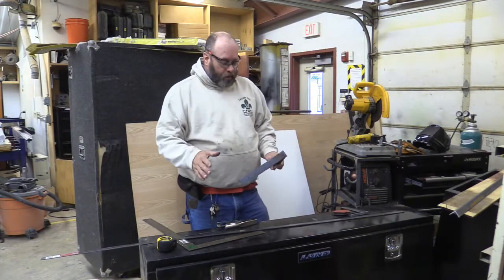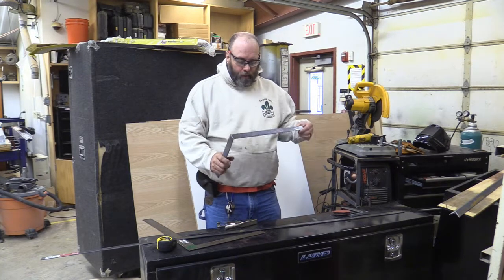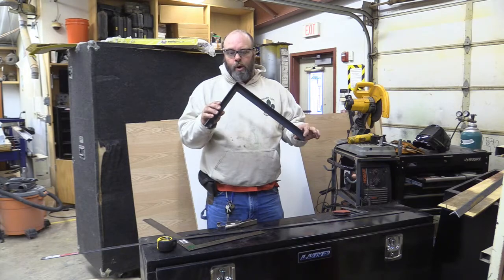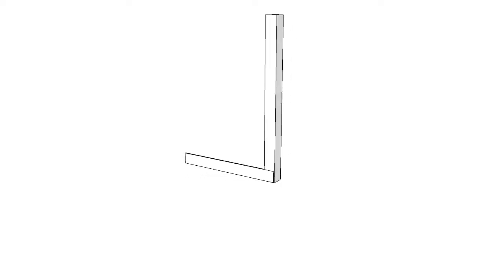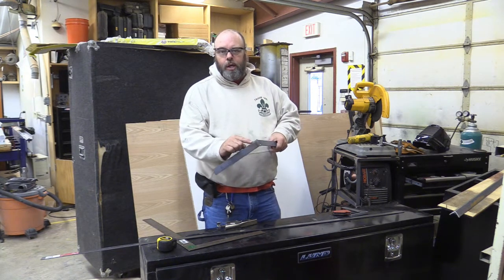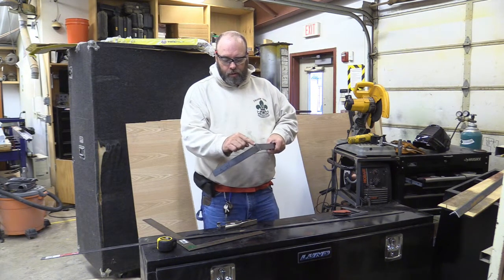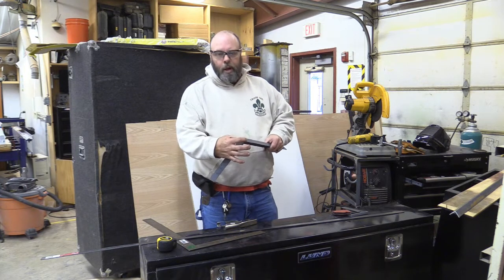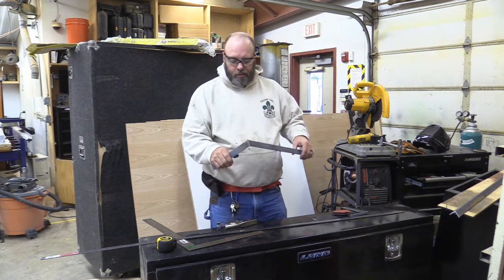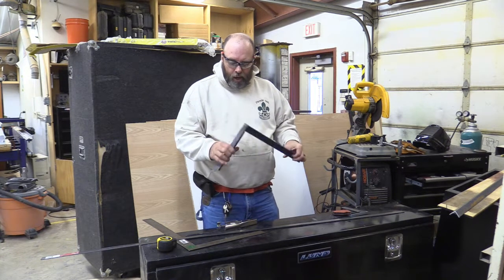Here we are inside the Warrior Woodshop, out of the rain. Off camera we've gone ahead and welded together our four L-brackets. I use a notch method rather than a 45-degree cut because one, I don't trust my cut-off saw, and two, in my opinion it gives three areas or lines to weld. This has about three inches of weld line, where if it was only a 45-degree cut it'd only have two, maybe two and a half inches.